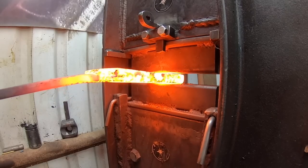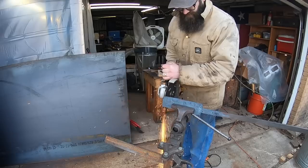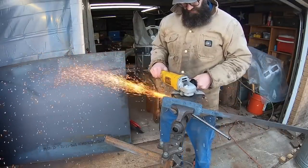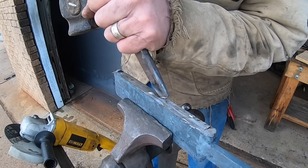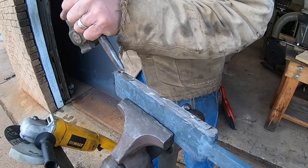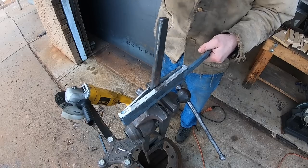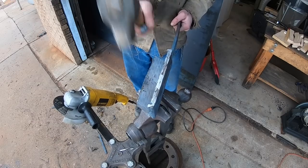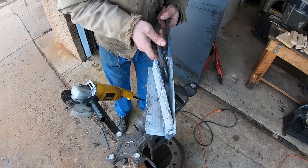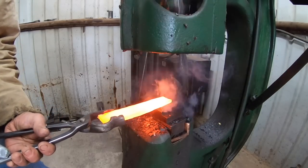After several passes I can go ahead and begin removing the canister — this is relatively simple to do. I just want to be careful I don't cut into the O1 tool steel rod, just into the mild steel 3/8 bar around the outside. The can should not be welded to the contents because of our white paint — it's the titanium dioxide content in the paint that creates that non-welding barrier, and in my experience that's the best method when doing a canister Damascus project. There's our billet and it comes out pretty easily with no actual fusing whatsoever.